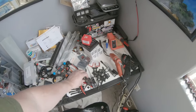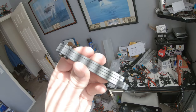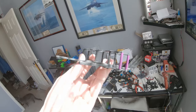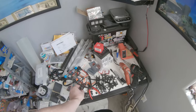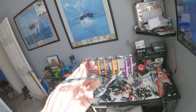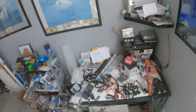I'm making a couple of Dave C frames - these are the three inch versions. I've got four inch arms, the arms are three millimeter, and I've got 1.5 millimeter for the top and bottom plates. I've got some pretty good clean cuts. The only thing I have a problem with really is the tabs, which I've been getting better on as I learn exactly what height and width I need for different bit sizes. On a 1.8 or 2 millimeter bit I can use a different tab width than a three millimeter end mill - so I either blow through the tab or have too much tab. That's just coming down to experience.